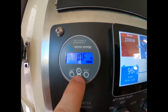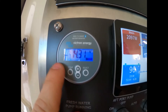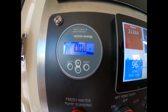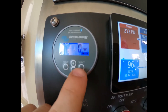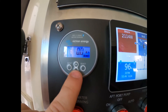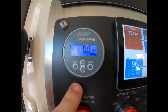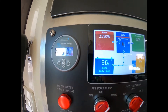It'll give you a time-to-go — right now it's saying infinite because we've got plenty of power. Voltage on the battery is shown, and that's the auxiliary batteries. You have two batteries; this shows amperage going in and out — positive and negative. It'll also give that same information in wattage — take the voltage and multiply it by the amperage. Amp hours shows how much you've pulled out since the last time it was charged, and then back to state of charge.